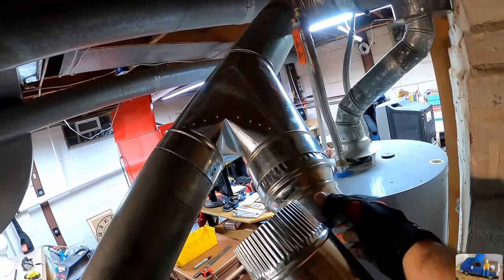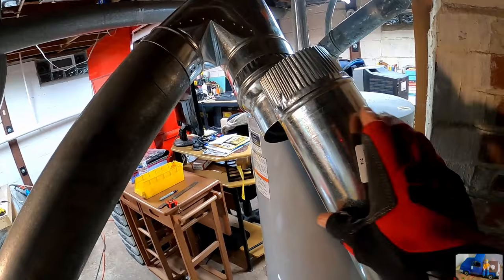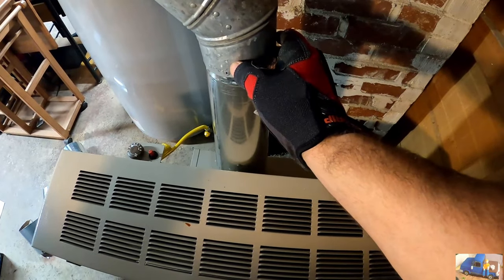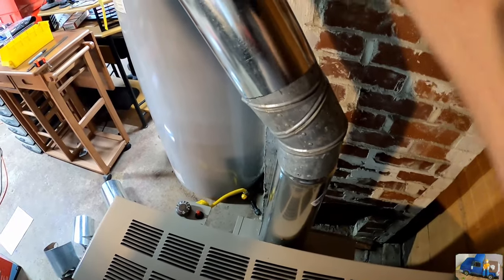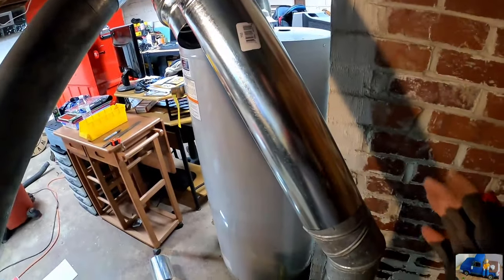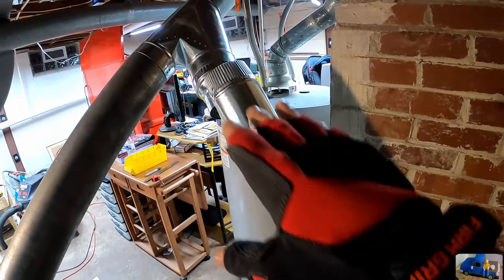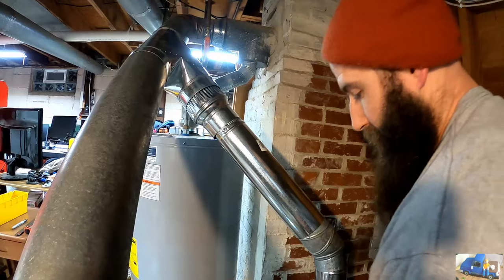Here's our Y pipe. Here's our reducer. And we cut a short piece here to traverse over this way. We have our adjustable elbow. Then we just cut a vertical piece so we can mate in here. Keep a nice continuous upward curve. So to get this guy into that, I have to move the whole heater this way a little bit, tilt it so the pipe is down far enough, and then get it fit in there ever so gingerly. Juggling match here.